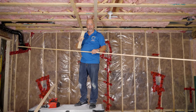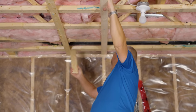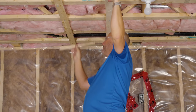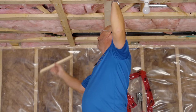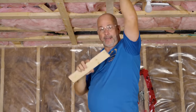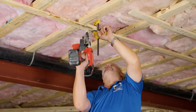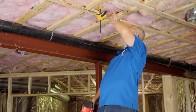At the end of the day, there's one other reason you want to use strapping: I am building a bulkhead all around this room and putting lights in it — it's going to be beautiful. Twenty-four inches out comes to here. If I don't have strapping, I have nothing to tie this bulkhead into. But now that I've got my strapping run, I'm going to be able to tie my ceiling into the strapping all the way along. I've already got myself blocked up and ready to roll — and this is a much safer way to do this instead of using your hand. There we go, now she's locked together.